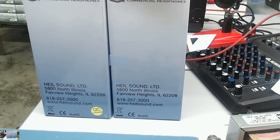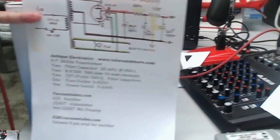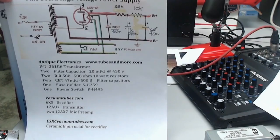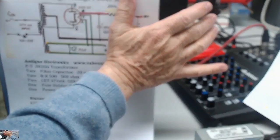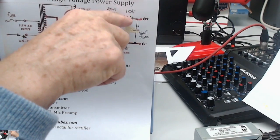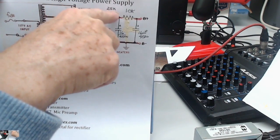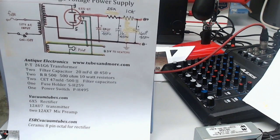In closing, here is what I did to the power supply. For you guys and gals that are building the supply: originally I did that just to get it going, but after I put the load on it, we have to put in another capacitor and a 10K resistor. We come out of here at about 300 volts, drop it with a 25K, filter it before and after, go through another 10K to drop it down a little more, and filter that. That gives you exactly what you need to make that power supply do its thing.